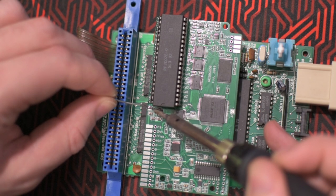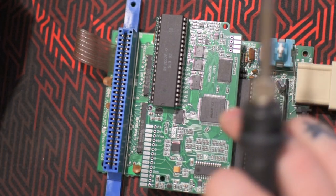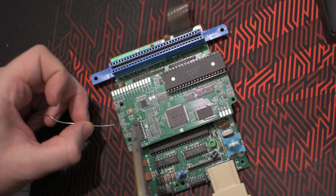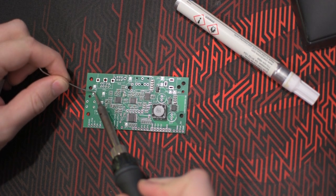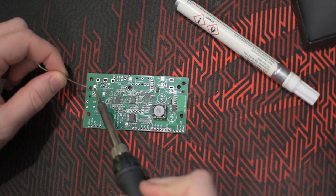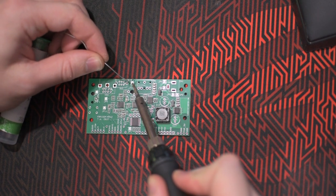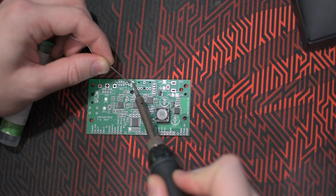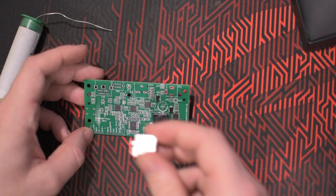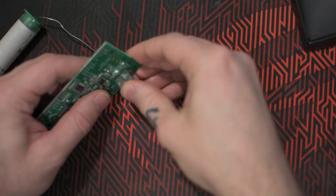You will need to solder the jumpers J3 and also J5. And on your new power audio board, you will need to solder jumper 7 and jumper 8 if you want the RGB from it and not the S-video. I will also have to add all the components to the board and make sure they're flat against the board, of course.